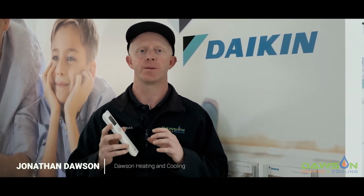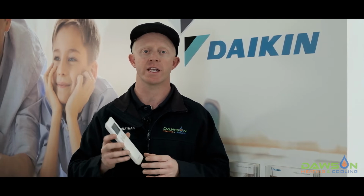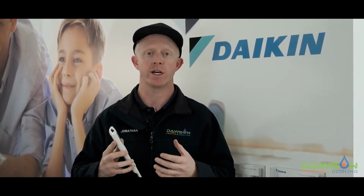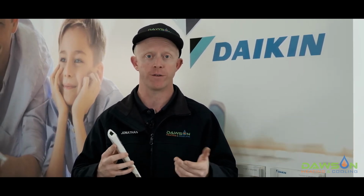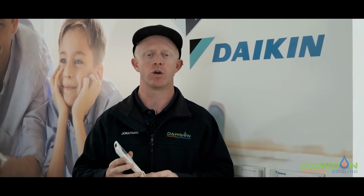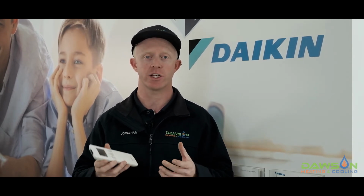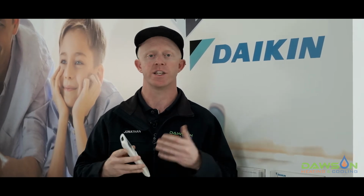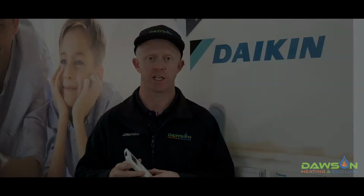Today I'm going to show you a couple of simple ways to set up the automatic timer on your Daikin wireless remote controller. There's two different ways you can do it. There's a 24-hour timer where you can set an on and an off schedule in each day, or you can actually set up a 7-day scheduled program timer, which allows you to set 4 different settings and different temperatures for each day of the week.